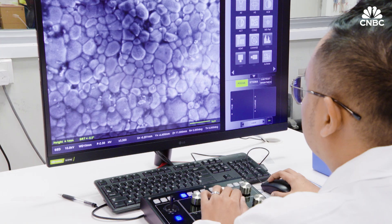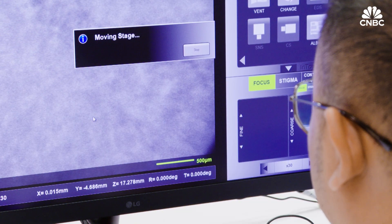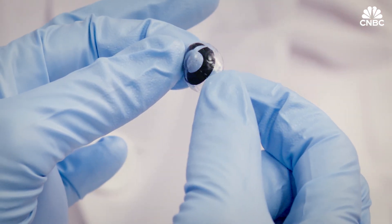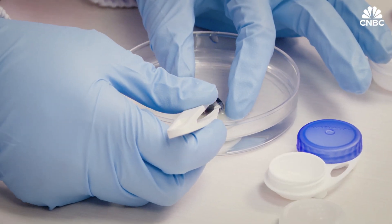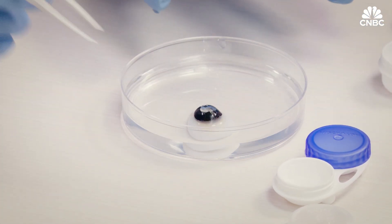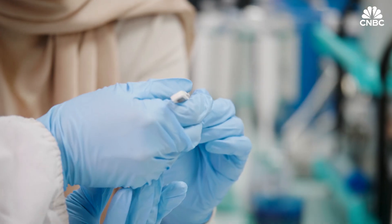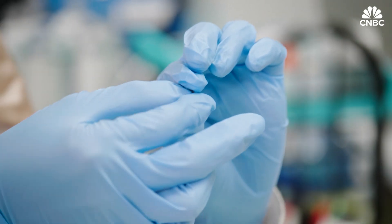We developed the electrode material working with these salt ions, and then implanted this electrode inside of the contact lens, which means we can save the volume of the battery. The battery is as thin as 0.2 mm, and it fits onto a 0.5 mm lens. To test that it doesn't obstruct the lens user's vision, Professor Lee's team has an artificial human eyeball which mimics the real application of the smart lens. We don't want some particles floating around on the eyeball, so we have to guarantee the mechanical strength of the lens. That's why we decided the thickness of the battery is 0.2 mm.